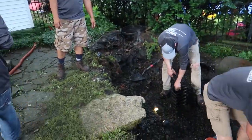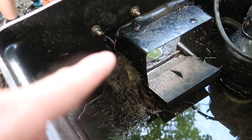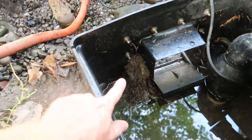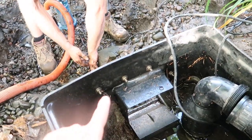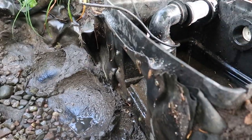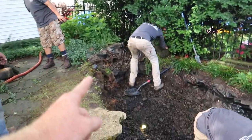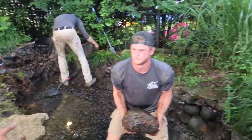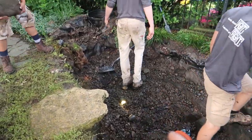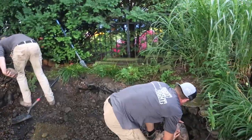We've only been here probably 30-40 minutes tops and these guys have been destroying this pond. The fish are out in their home for the weekend — we've got some plywood over it just so they don't jump out. In the skimmer here, all these branches and roots growing inside — that is 100% leaking. This pond has been draining water through those roots for a while. The roots suck up water and they break that seal between the skimmer and the liner, which is where your waterproofing comes from. But that's not a problem because we are tearing this whole thing out — new skimmer going over there, new biofall going right here, raised up a bit. We're going to change the shape, go just a little bit deeper — 24-inch depth. That cantilevered edge rock right there we're going to keep.